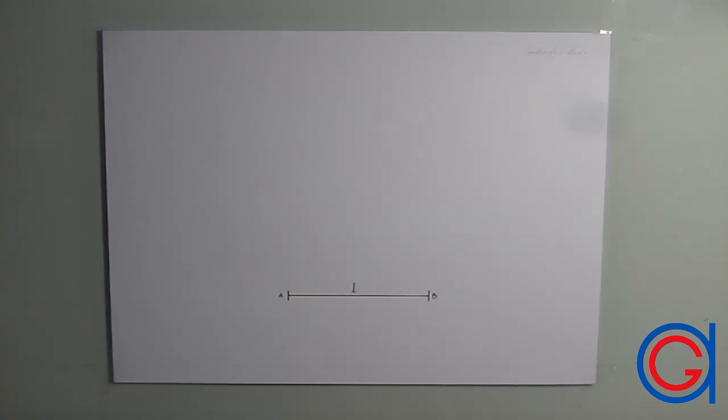Hello. In this video we are going to learn how to draw parallel lines and perpendicular lines using our set squares. The 45-degree and the 30-degree set squares are the two most commonly used instruments in technical drawing, along with the compass, rulers and mechanical pencils. These technical drawing tools should be well maintained to ensure accuracy while drawing, keeping the edges of our rulers or set squares clean, scratch-free and without damaged edges.